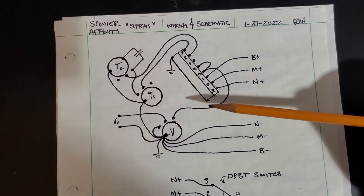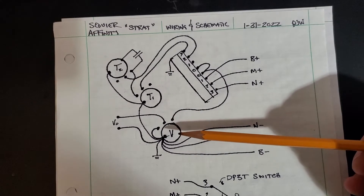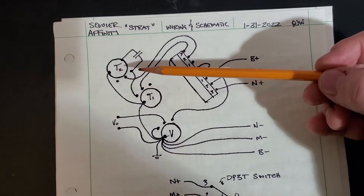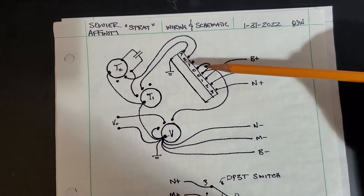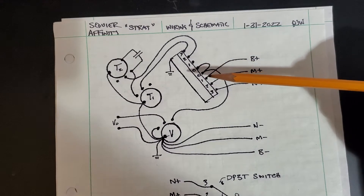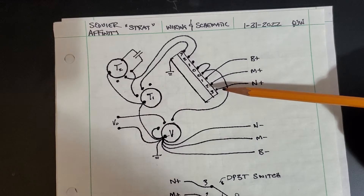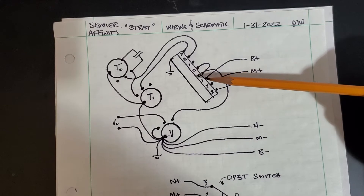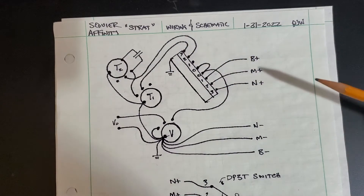What you're seeing at the top here is a wiring diagram — imagine you're looking at the pickguard from the back. You can see the volume control, the tone control for the neck pickup, the tone control for the middle pickup, the capacitor used for both tone controls, and the five-way switch. This is an Asian-made guitar, so it has an import switch with a slightly different layout than an American Fender, but functionally it's the same — a double-pole three-throw switch. The two poles are marked zero, and then each of the throws is one, two, three on each side, so it's really two switches in parallel.